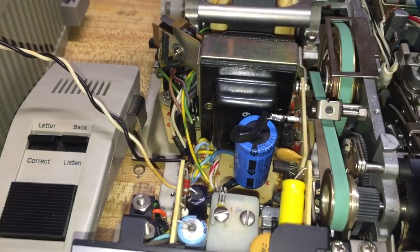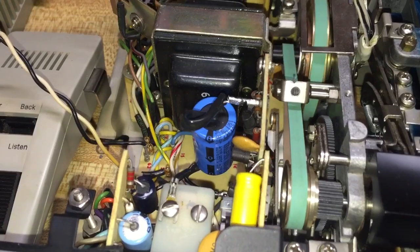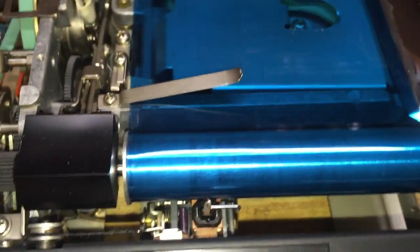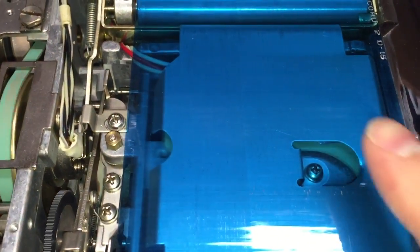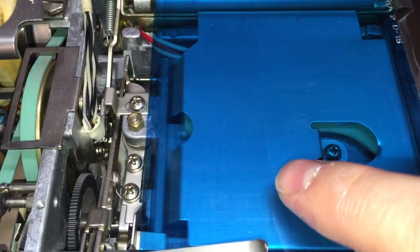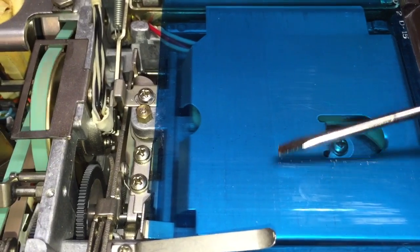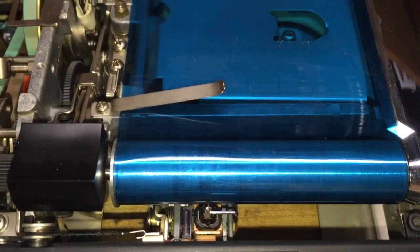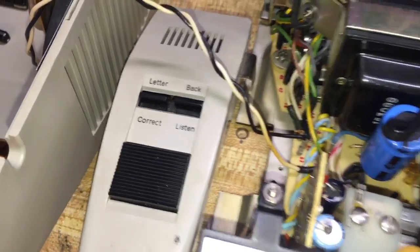Some kind of a fault in the sense that I would say maybe even a short, because sometimes you'd hit record and it would record just fine. Other times it would just become static. So to do a recording, you mainly just move your stylus to the end of where your grooves are. I don't know if you guys can see, but that is where the recording ended, right there. So my recording ends here, because you can see this darker line over on this side, or stripe. So I would move my little meter up to align with that, and then I would push the big black button, as we showed here.